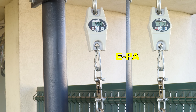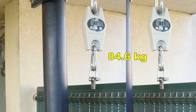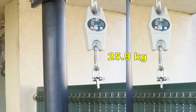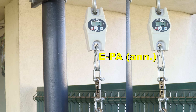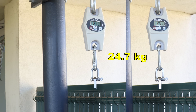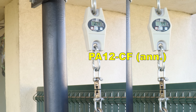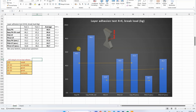Layer adhesion test: EasyPA average from 2. In the first test there is quite a big difference. EasyPA with zero part cooling is super strong. PA6 CF — a little bit disappointing but still acceptable. PA12 CF — fantastic layer adhesion. Annealed versions: EasyPA still has very good layer adhesion. PA6 CF — no improvements but still acceptable. PA12 CF — no big changes but still good. EasyPA and PA12 have fantastic layer adhesion; PA6 CF is still acceptable. Annealing didn't really change things significantly here, unlike part cooling — EasyPA printed with 0% improved layer adhesion significantly, but this depends on the object: big overhangs, bridging, or small cross-sections will cause problems.